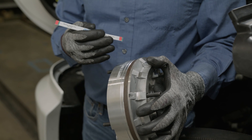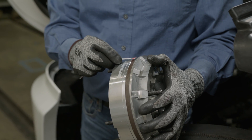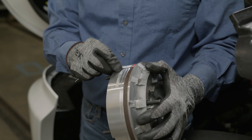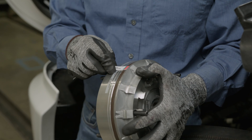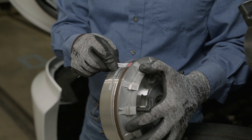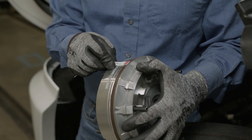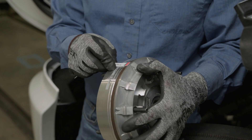This happens to be an on-off modular clutch, so we're going to use the on-off side of the gauge. You hold it up against the friction disk. As you can see, we still have green where the liner is. If the liner started to wear, we would get into the red area. Once it's all red, it's time to replace the clutch pack — not just the cartridge and face seal.